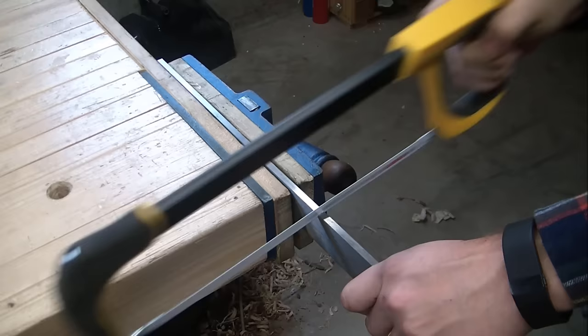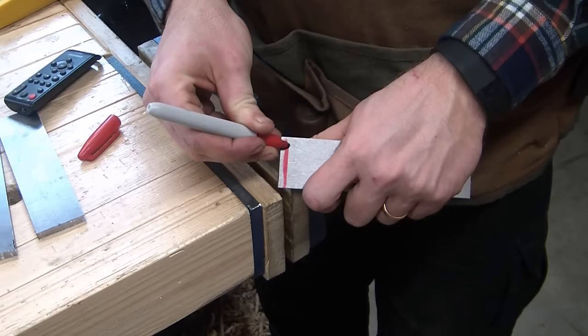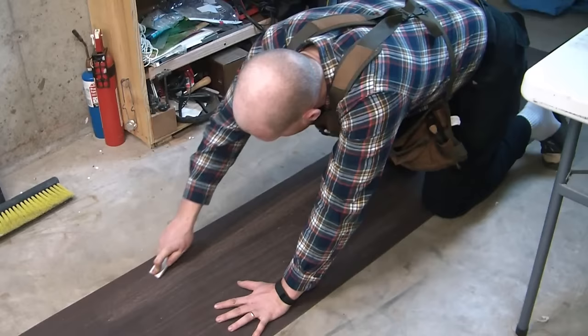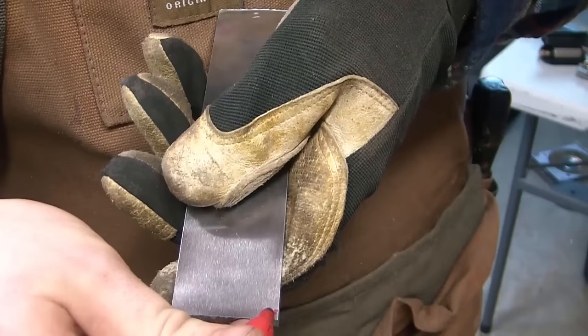So first off, let's go through building the iron. I started with quarter inch O1 steel by half inch and cut it down to about six inches. In order to make the tip on the iron, I used a red sharpie to mark out what I needed to remove, and that way I could get back to it. This is a piece of sandpaper, two foot wide by 20 foot, and I got it at a resale shop for a buck — amazing find. It actually makes fairly quick work; it was only about 20 minutes of this in order to get the angle down to what I wanted.